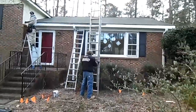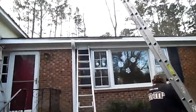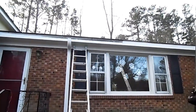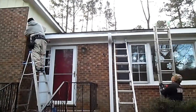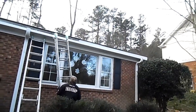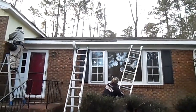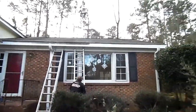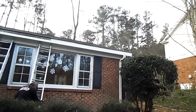One thing to point out is when we remove these gutters, we actually caulk and paint the fascia boards, because the new set of gutters are going to be on here a long, long time. This is just an added protection for what we do out here, as well as making the house look much, much better. This is a step that you really don't want to leave out.